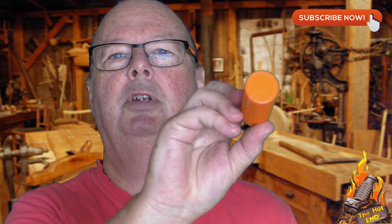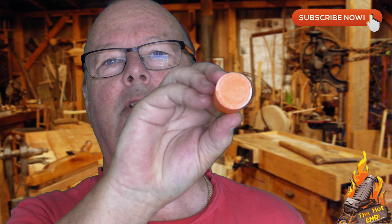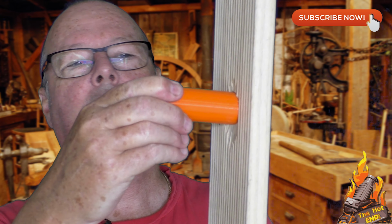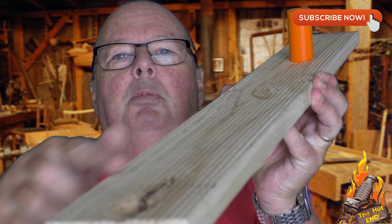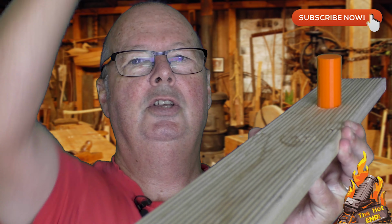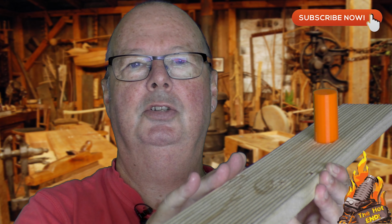You get some big dowel, which I didn't have, so I 3D printed some, it's basically lumps of round plastic, but it's 3D printed, and they go into the holes like so. Okay, one there and one in that hole. You put your timbers that you're gluing flat on here, then you put another one of these on top, and then another two at the other end, so you can keep everything nice and square.